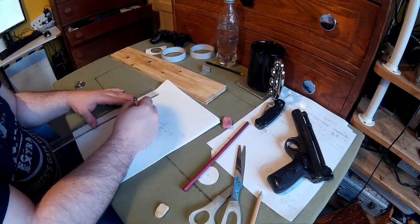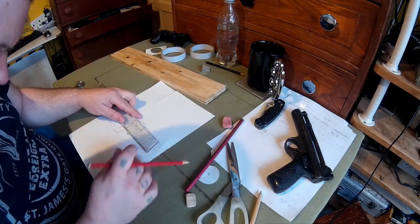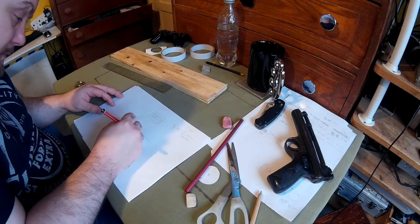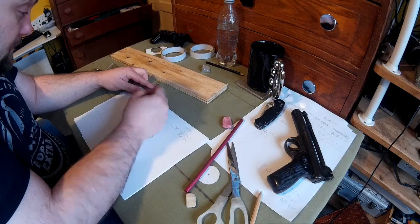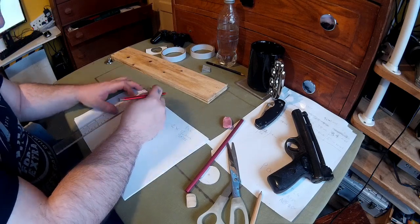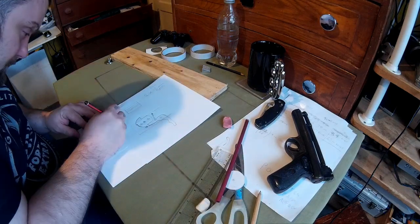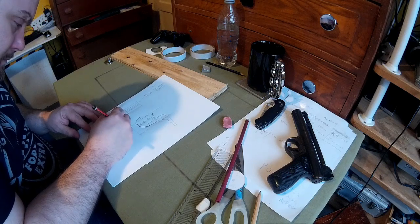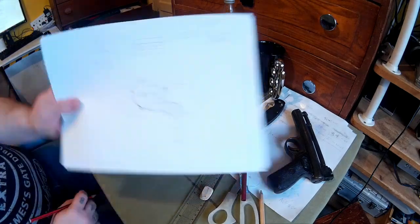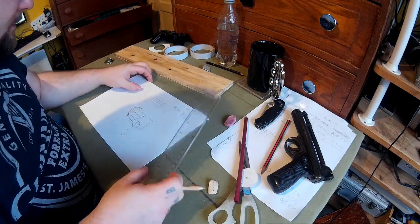It's all going to be made from scrap materials — very simple but should look good. I could make a much more detailed trigger but I like to make things as simple as possible while still being good. The roll-nut is going to have a groove in it where the bolt goes, to make sure the bolt is sitting right on the string. I'm designing this as a separate trigger block — it's inserted into the stock and bolted in place, not an integral part of the crossbow.